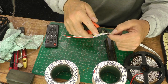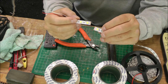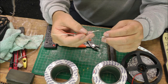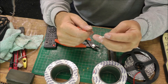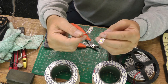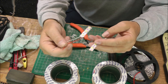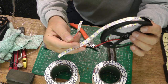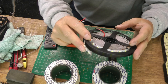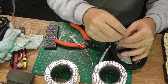If you want to cut this here, you cut it like that in the middle of that brass, and then you can re-solder more wires to that, get more wires to your required length, wire it up exactly the same way, and put it all into a terminal block. Okay, it's as simple as that. So you can add as many as you want, because that one transformer will do the whole reel. And they're only 6-7 quid.